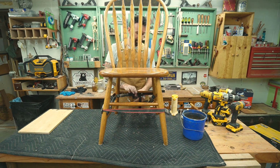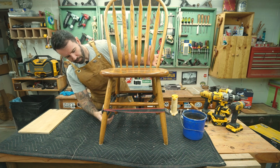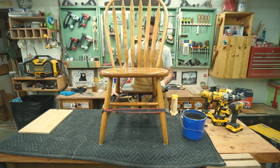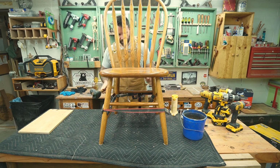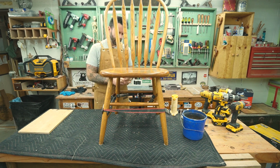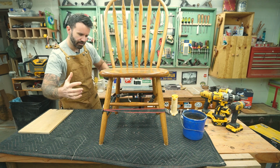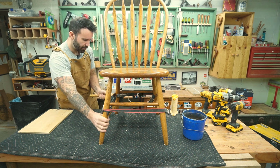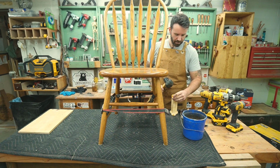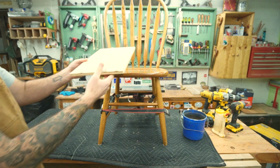And maybe give it one more click. You'll see a little bit more glue squeeze out. And I always like to just take my mallet and make sure it's, if it is going to go any more, if there was anything that needed to budge, when it's got that band clamp on, it'll go when you smack it with the mallet.